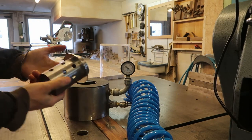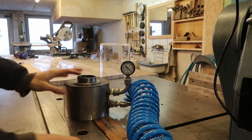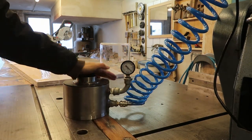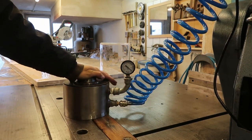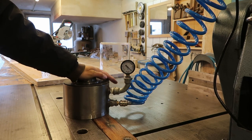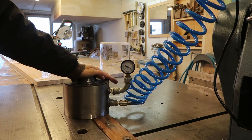When you have a plexiglass tube on it, you can degas flasks or your mixed investment in the top part of the machine. And the second function is to remove the plexiglass tube and drop the flask into the bottom portion. The flask would obviously be invested at this point, and you would be pulling a vacuum on the bottom side of the flask through the plaster.